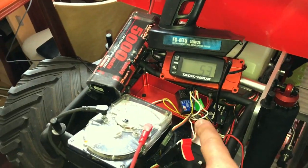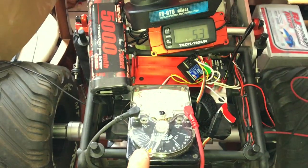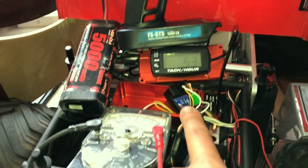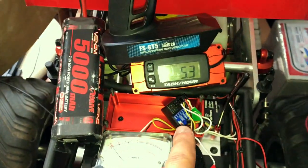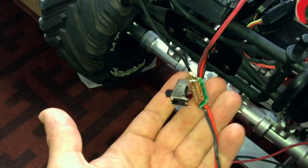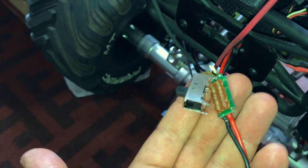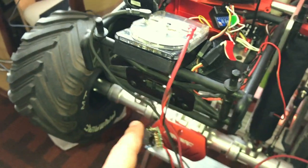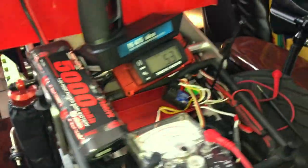Now, first I thought I had some kind of radio system fault because I couldn't get this thing to turn on. So I was using a multimeter here to literally test for resistance in every single wire. It turns out that once I plugged in a different battery pack into here and bypassed the entire wiring harness on off switch, it worked. So the system is good. It's just that replacing the stock on off switch is not that easy. I tried to open it up and fix it. There are these little jumpers that should be here. They are missing. I took them out, but that's my fault. This thing is not fixable. So I'm just gonna replace it with that other power switch. I'm gonna solder in a connection. I'll still be using the same battery pack. In fact, I think this is actually better.